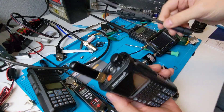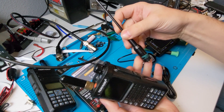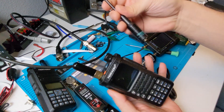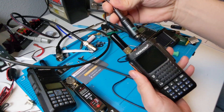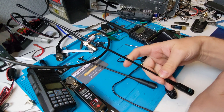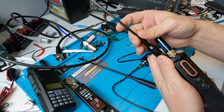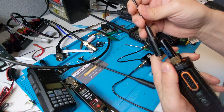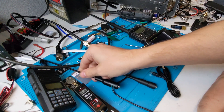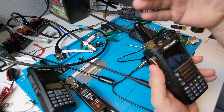If you need a little bit more range, maybe the stock antenna. And if you need even more range, you can get yourself one of these 771s — there are a lot of different versions, just find something with good reviews, or get the one that TID Radio sells, their own little Nagoya clone. This thing gets out. If you know how to hold an HT and get this thing going, or go the extra step and do a counterpoise — a little pigtail that comes off here — these longer ones really do get out. It becomes less about how many watts of power you're putting out and more about your antenna setup.